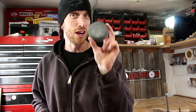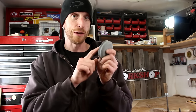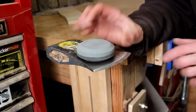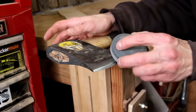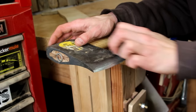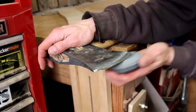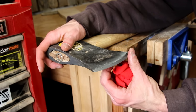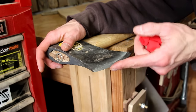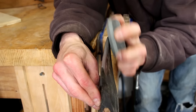We're going to step it up a notch using one of these little sharpening pucks. This one is made by Lansky — not sponsored, but I've used several Lansky products with a lot of success. I'll put a link in the description if you're interested. I'm going to start with the stone on the rougher side using some 3-in-1 oil, and even after only a few passes I can already feel the edge getting refined and more sharp. Once I remove all the file marks with the stone I'll switch over to the finer side and finish the edge.